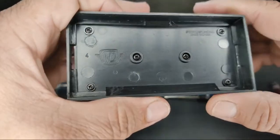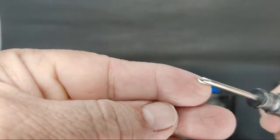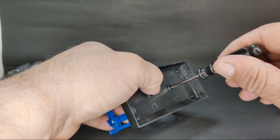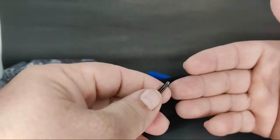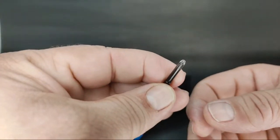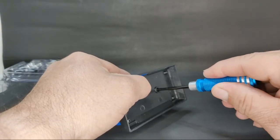If you look at the screw, you can see that the area is not deep. It's actually flat. Now they did include a cheap, what looks like a Phillips, right? And it grabs pretty good. But the secret is, if you have an extra one, take your Dremel with a cutting disc or something, or sandpaper, and just sand down the tip. By sanding down the tip, it helps for those sides to go in deeper, and it grabs.